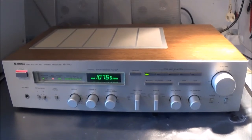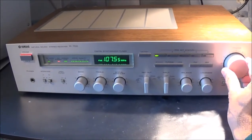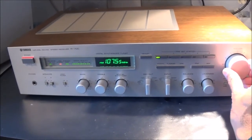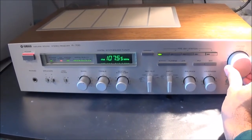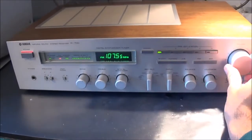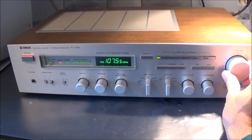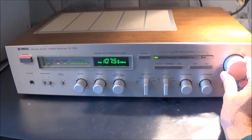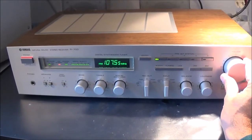So I actually got loudspeakers hooked up now, and I've got it on the FM channel. Oh, I hear some kind of scratching noise from the right speaker. Okay, the left speaker is okay. It's still there on the right speaker, so I'm going to try a different function and see if this thing still makes that scratching sound, to kind of localize the problem.